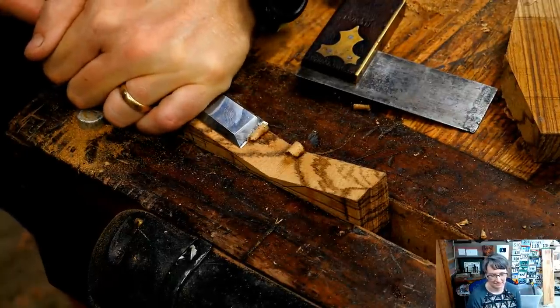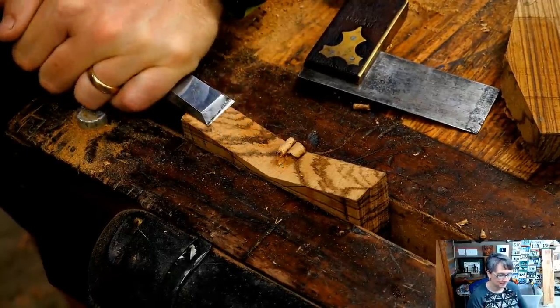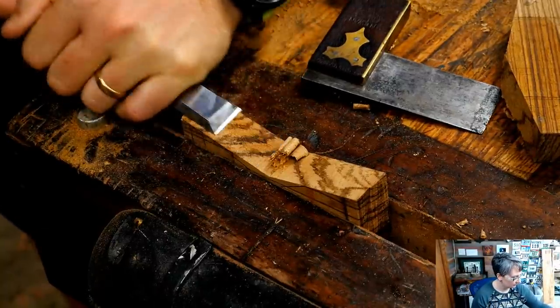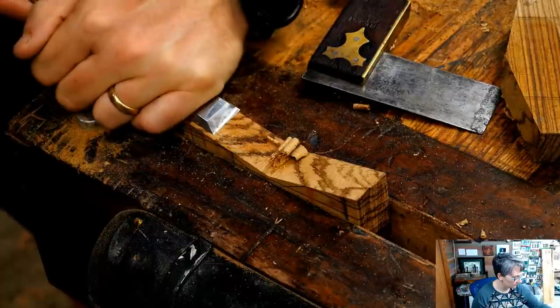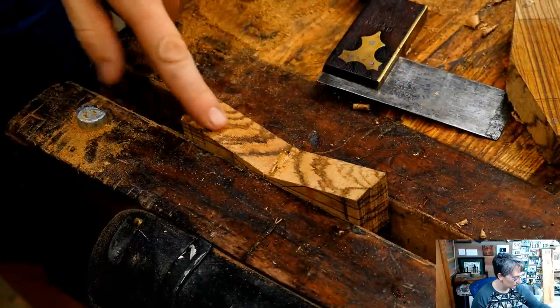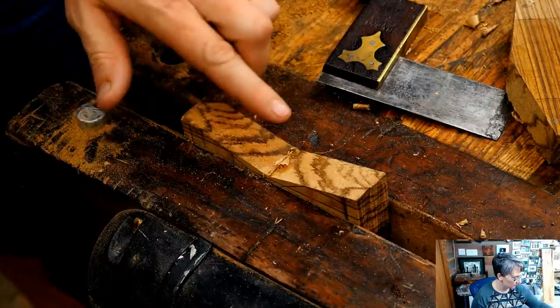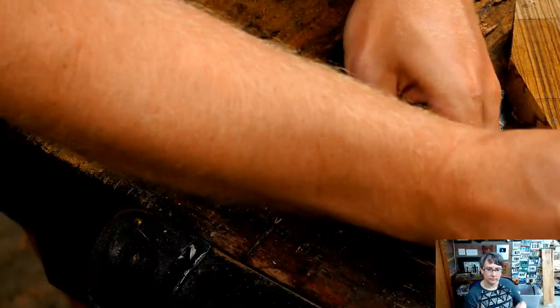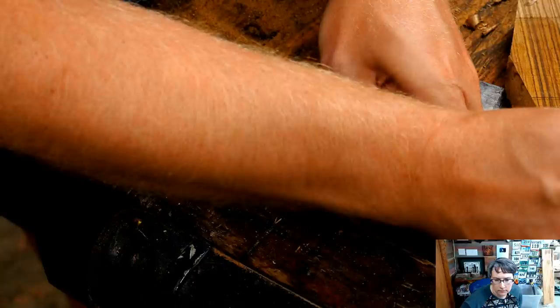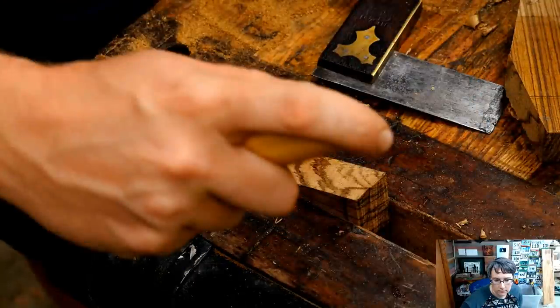I'm going to use this as a plane to slowly chisel down. And it's very, very important that these edges all be square. Because later on, you're going to be referencing to it. If the edge isn't flat, that's okay. But this edge has to be square to the bottom or top. And yes, I am chiseling towards myself. I would turn around and go the other way, but the camera's over there right now. So any questions while I'm doing this?